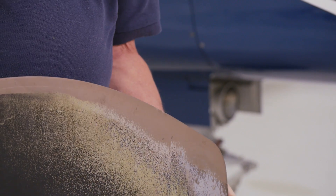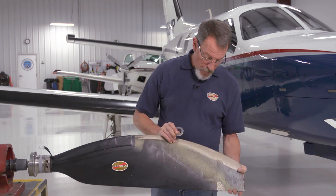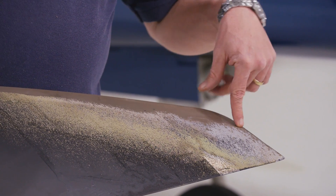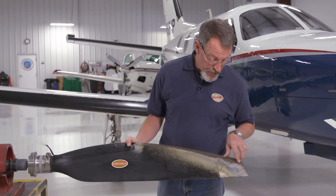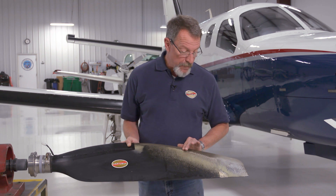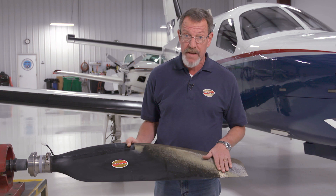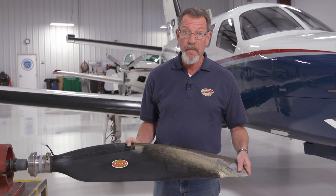This damage here, while it's a minor deformation, has little to no debond associated with it — it taps out rather nicely. So we've got some paint damage, some exposed erosion screen out near the tip which can appear to be exposed composite material, but if you look at it closely it's actually a metal screen — perfectly acceptable. You've got quite a bit of paint erosion, perfectly acceptable, and a very small crack, perfectly acceptable. All of these can be taken on a flight without any further maintenance, and can be attended to after the flight or once the aircraft is in a location where it can be maintained properly.